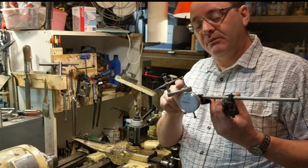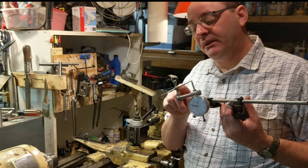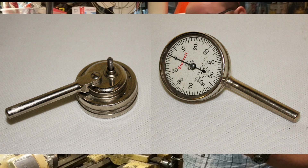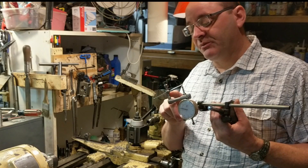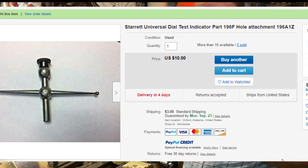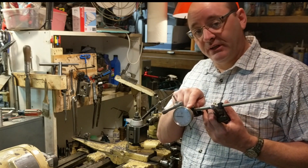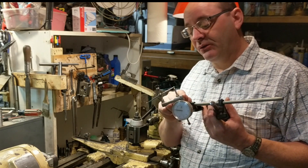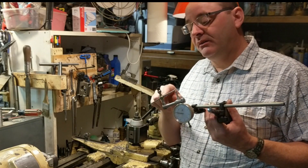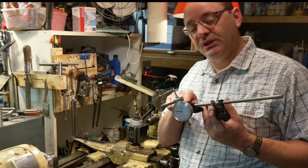Starrett makes indicators and they make hole adapters that all go together. This one is a Starrett 196. It's kind of a white elephant — it's for an older style of indicator that isn't terribly popular. So this hole adapter from Starrett can be had for about $15 all things told, but it does not fit a common Starrett indicator. In fact, it won't fit one of these cheap import indicators no matter what you do unless you build one of these. This video is about the Starrett hole adapter adapter — how to put a Starrett 196 onto your cheap import indicator.